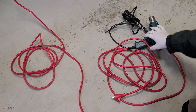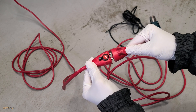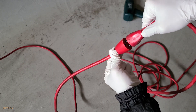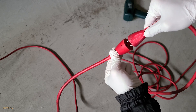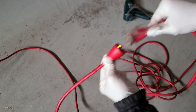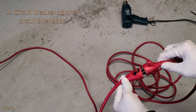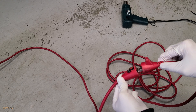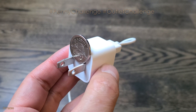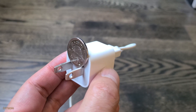To set up this experiment, we turn on the heat gun. Under normal conditions, even with the appliance on and you quickly plug it in, there shouldn't be any issues — sometimes you just get a very small spark, which is okay. Things can get ugly when we have loose contact caused by vibration. You may ask why the circuit breaker doesn't trip. The circuit breaker only protects against an overloaded circuit. In this case it's not overloading at all — my breaker is rated at 15 amps and we are drawing 10 amps. The breaker is doing what it is supposed to do. Remember the TikTok penny challenge? This does not necessarily trip the breaker, but it can start a fire.